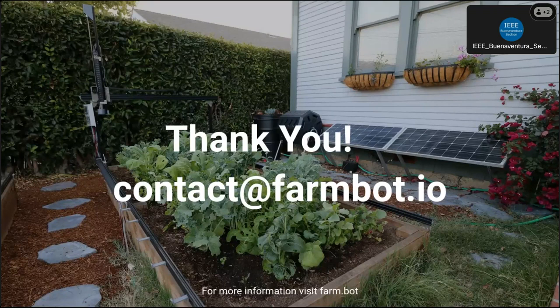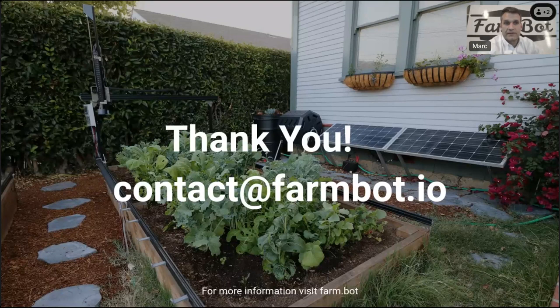No. So the FarmBot is weatherproof. The FarmBot can stand up to heavy rains, it can stand up to high winds, and it's able to manage any kind of weather. We also have folks up in Canada that keep their FarmBot outdoors all year round, and it's able to manage cold temperatures as long as you blow out the lines and ensure that there's no water in the lines before you secure it for winter time.